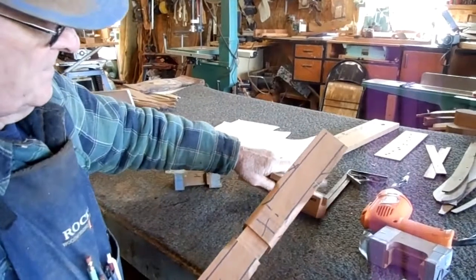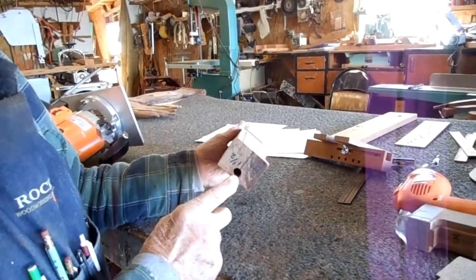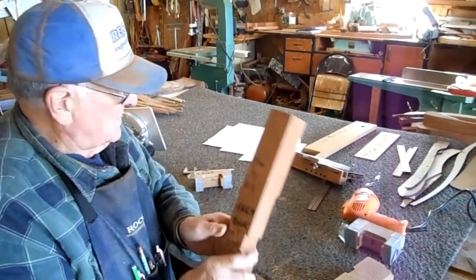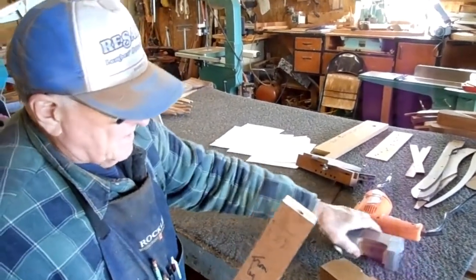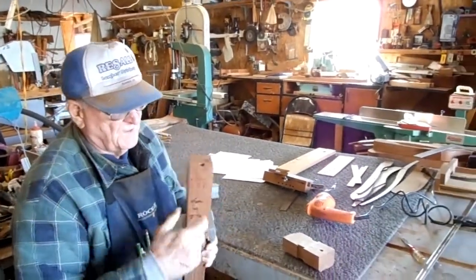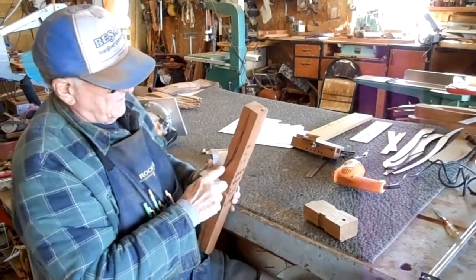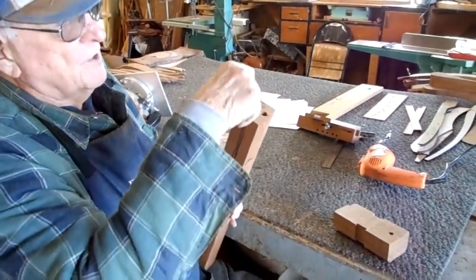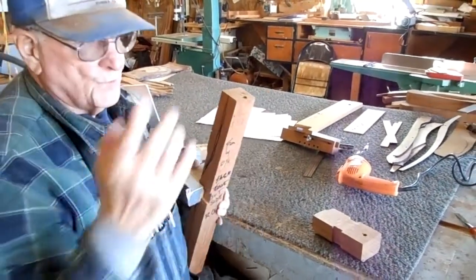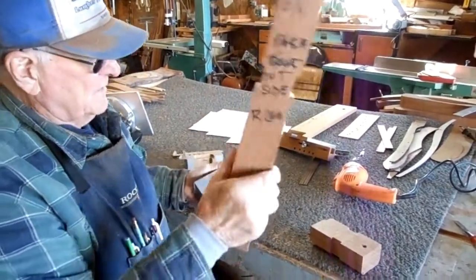Now, the top and the bottom of the leg has to be drilled with a 13mm hole. And make sure you drill the proper side of the leg — that is, the outside edge of the leg, not the inside. Because you're eventually going to cut this portion off of the leg, and if you've got a hole in there it's going to be gone. So make sure your holes are on the outside. Read the instructions — it'll tell you. Put a 13mm hole in there. That's your front leg.